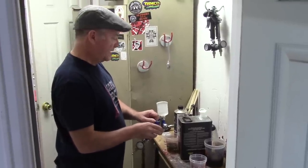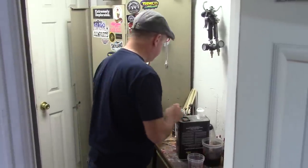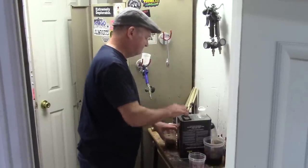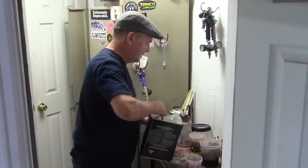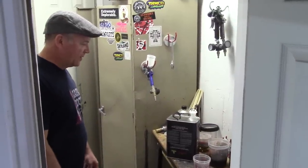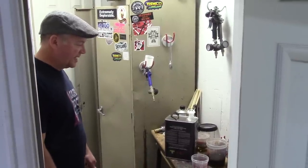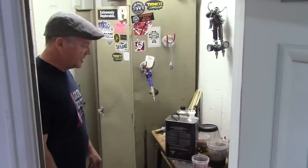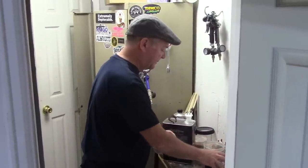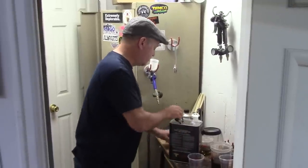I do too. I think one of the reasons that people get that super hard line when they're doing sunburst is they aim the gun in a direction that they think is safer. That is to say, they aim the gun off the body rather than towards the body. Or directly at it. I watch that guy from Fender spray a lot, and he changes it up depending on what he's doing and what the look is that he wants. Because he's going for specific looks. So for a classic look, he sprays it direct to get that harder edge.